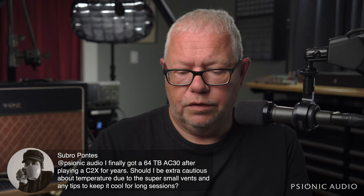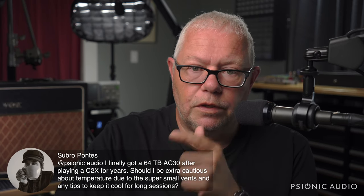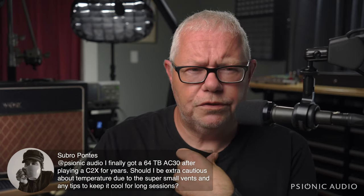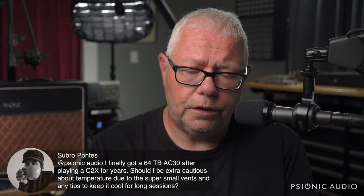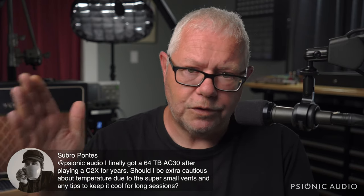I know in Europe you can do a trick where you are giving it nominally 220, but you set the transformer's tap to 240. Where's the 230? I'd have to look. I've got the big book over there. There are two options for European use. You feed it a lower voltage, but you set it to the higher one, helps it run cooler.